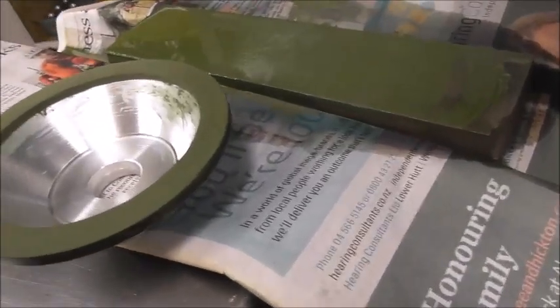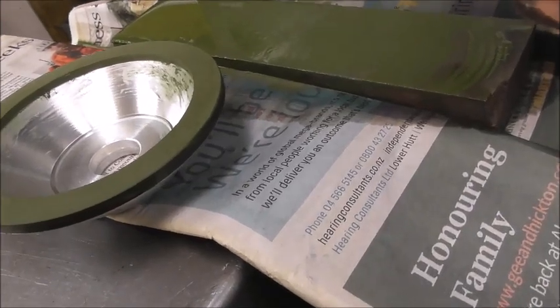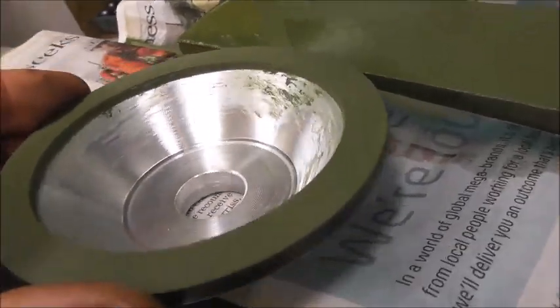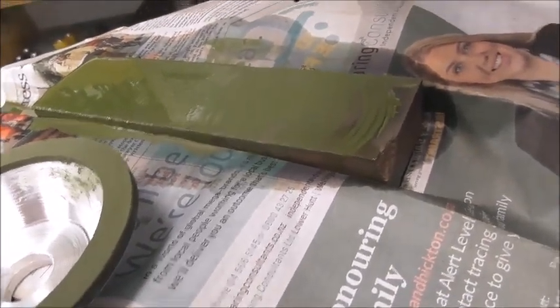Look at that — it works! I'm slightly excited here. Found a way to dress the hardest of all materials — diamond. You can see the green has come off on the stone, and there's slurry over the wheel. Look at the finish on that wheel — it's beautiful now. We know that it's running true and concentric, and it only took a few minutes with some kerosene on an old woodworking grindstone.